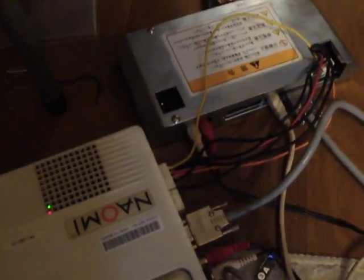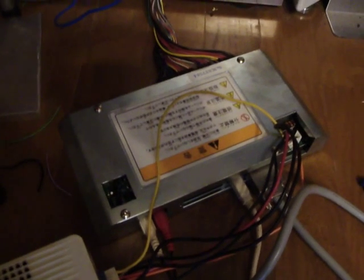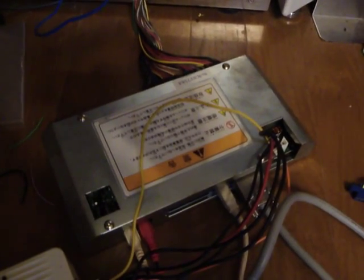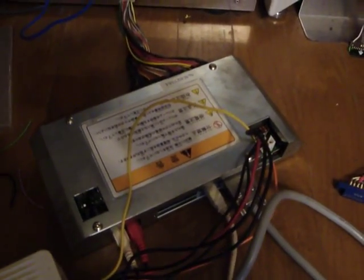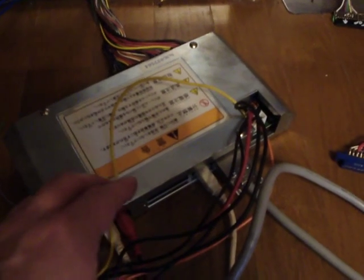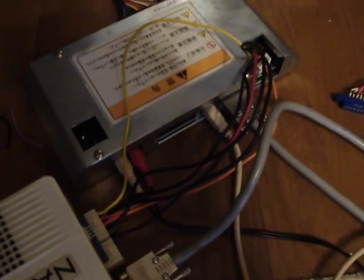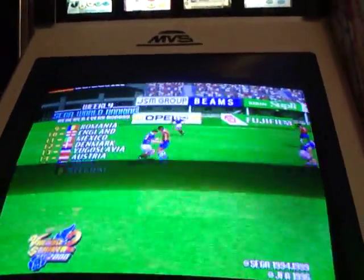These boards have different switches on the inside that allow you to change sync or different monitor settings. It also has a test switch — a couple of test switches on the side — if you're having problems with the system. It also has a couple of dip switches to change different things in the menu. That's a little bit about the Naomi 1 system hardware and how to wire it up. I'm not showing how to wire up a GD ROM system or a Naomi 2 board, but with a GD ROM system you'll need a DIM adapter for the top and a splitter to also send power to the GD ROM itself. Thanks for watching!